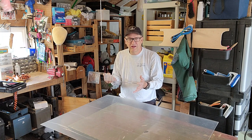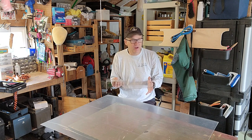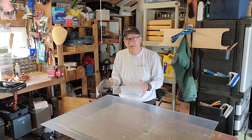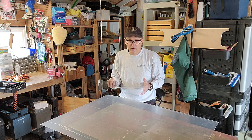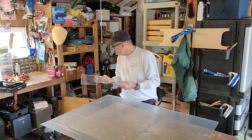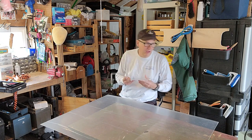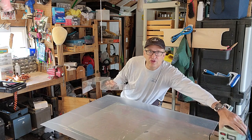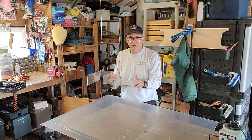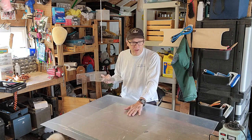My latest was a TD-160 that I just refurbished, and the last thing it needs is a dust cover. So I thought I would renew my old DIY post on how to build dust covers — it didn't really go into a lot of detail. I'm going to go through it in more detail in this video to show folks how I did it, and to show my DIY bending machine that I constructed along with a Variac, which you can use to energize it and actually bend and make nice folds in acrylic. So I've got a sheet of Lexan here — acrylic, whatever you want to call it.